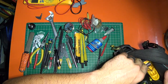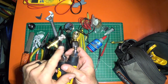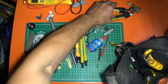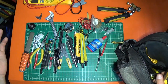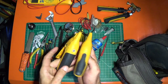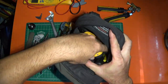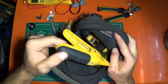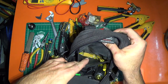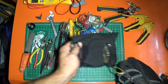In the main pouch, I've got my Field Piece smart probes. I did a video on smart probes showing what all this is so I won't repeat that, but I love the range on these things — it's incredible. I can set them up on a semi-hermetic and watch it pump down from being inside the cooler. If you're wondering how I've got that organized, they just go in this back clamp and the probes are right in there. Down in there I've got the thermocouples for my meter.